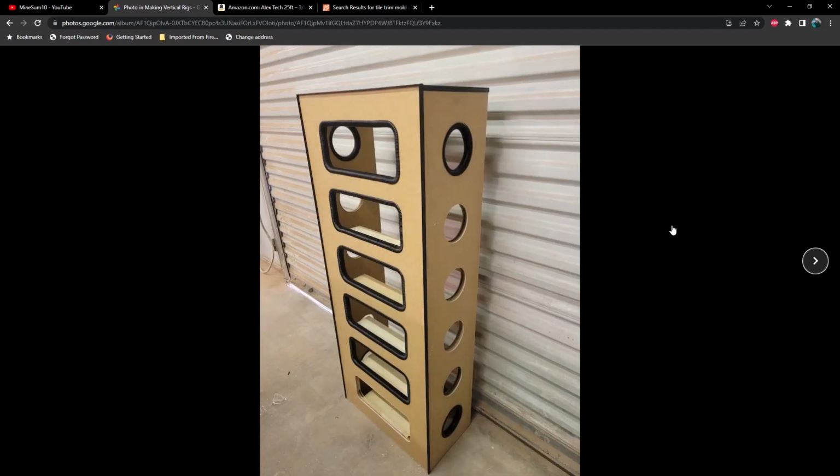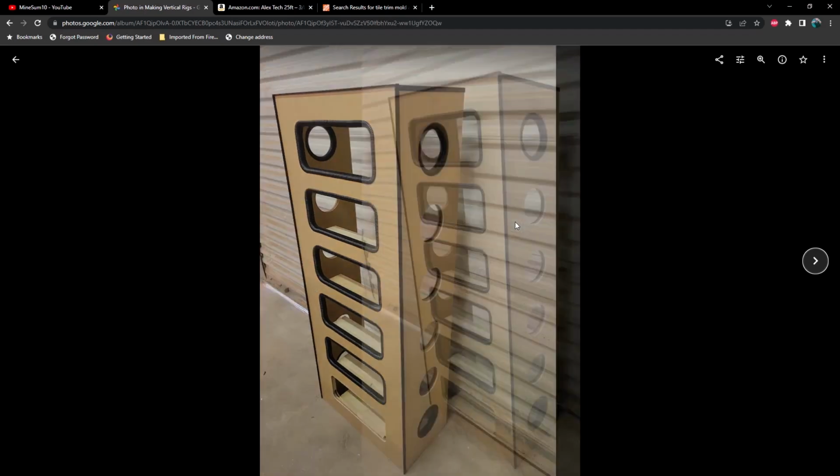Now measuring out the loom here is pretty easy. Essentially what I did is I just spread the loom, wrapped it around, and then cut excess. You know, I gave myself about 1 inch to half an inch longer, and then pushed it all up in place and then cut it to be perfect with a razor blade.